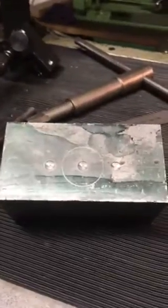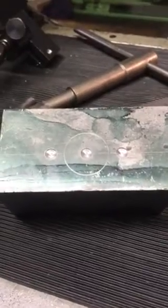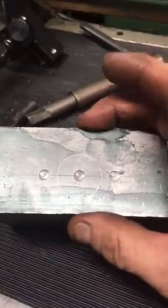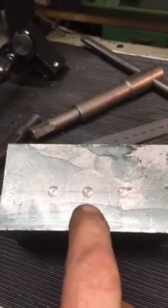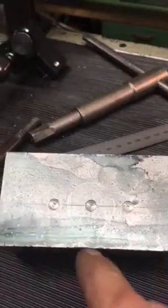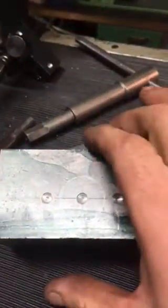Welcome to the Home Engineers channel. Today I'm going to talk about setting up a job in the four-jaw chuck when you've got reference points or datum where a hole needs to be. The stock material is 100mm long, two inches wide — 50.8 by 50.8mm. The hole is central along this plane, so it's 50mm from the end and 21.4mm up from the base. That second dimension is going to be a little more difficult to set, but I'll show you how to do it quite simply.